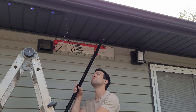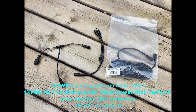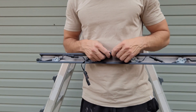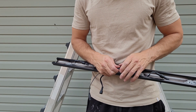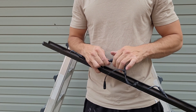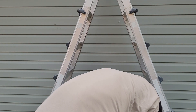Here we've got the 40-foot mark. I usually hold the cable there just to mark on the LEDs where I need to separate them apart. Starting from the left, you're going to have the cable that hooks in between the LEDs, then your Y-splitter for the power injection cable, and then another 20-foot extension. I'll take that power injection splitter and hook it in between two lights — they just screw in there. There's a DC barrel connector on the end, because this house runs over 80 feet so we're going to go another 40 feet from this point.